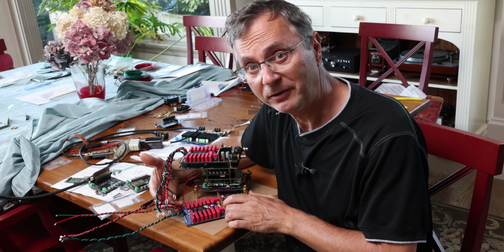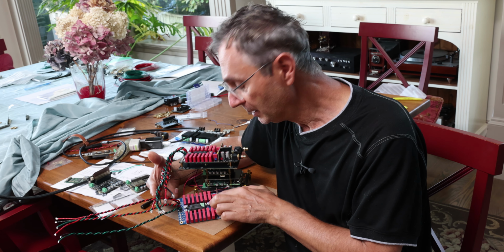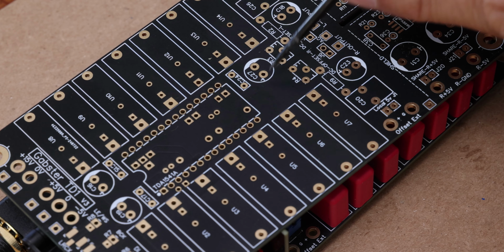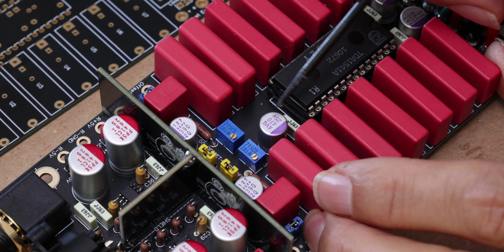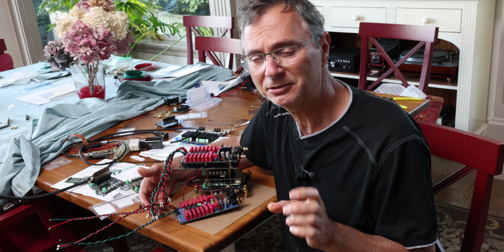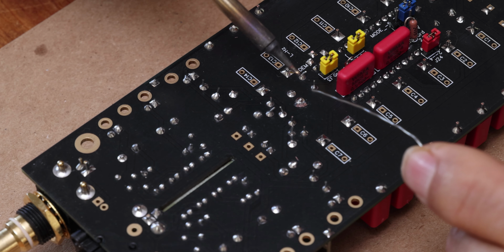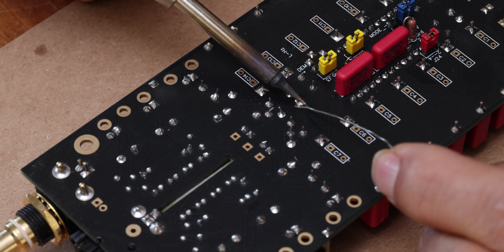First, let's start with fixing the small error on the TD1 board. There is one capacitor, C27, where one of its pads should be connected to ground and is not. Luckily, it's a super easy fix. I'm going to show you how to do that. It doesn't seem to affect the sound, but it could, and it's something that is not correct and should be addressed and corrected.